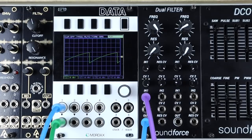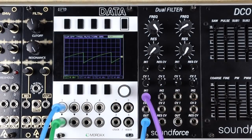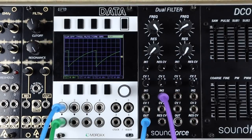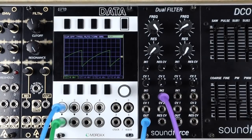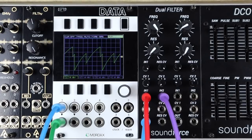A quick word on input/output levels. This is your standard 10 volt, plus 5 to minus 5 volt input from a standard oscillator. Going into input 1, even with the level up full, you do lose a little bit of signal — they've dropped the gain staging to allow more headroom and keep the filter cleaner. Going into input 2, you get quite a lot more output, still with a tiny level drop. In practice it's meant absolutely nothing — I've used it like any other filter.